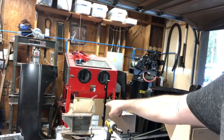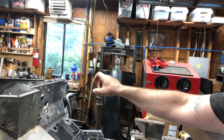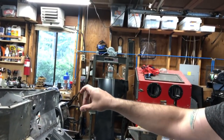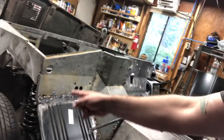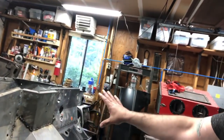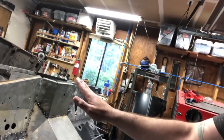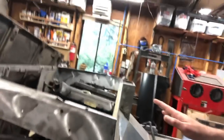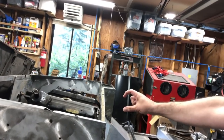The brake pedal assembly, okay, right there. It bolts to that firewall, and that bolts to your cowl piece that your windshield sits on, okay? And then your dashboard indexes into the cowl piece and locates your kick panels. So all these systems are completely interlinked. And if that firewall is too far forward, that is also one of the reasons why all my dimensions were screwed up. And the angle, when I had my door here, my windshield angle was so screwed up, and I had that big gap at my windshield frame. So, that's how these things go.